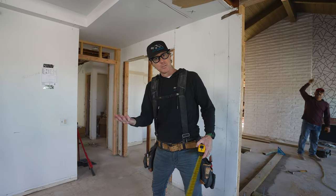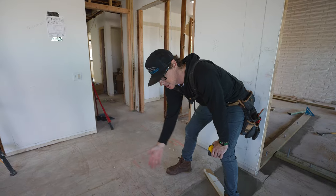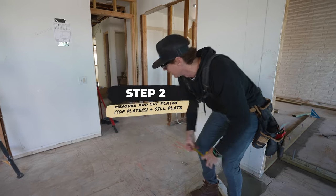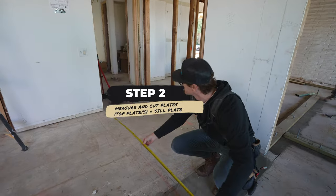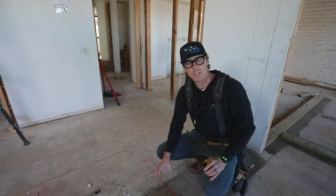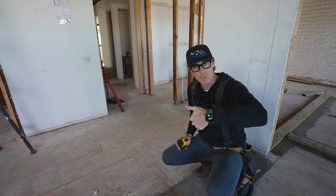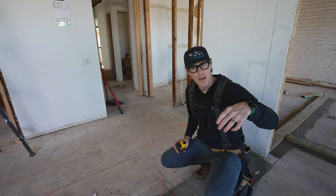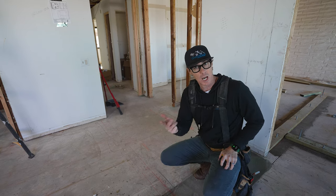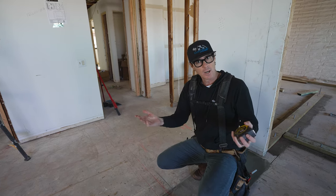Now I'm going to measure for my plates. We've snapped our plates down on the ground — this is where the wall is going to go on the floor. I tape in and measure: we're looking at 80 and 7/8 inches, so that's our plate dimension. Typical wall framing is a single plate on the sill, then a top plate, and then another plate on top — two top plates and one bottom plate. I'm going to measure and cut both my sill plate and first top plate right now.